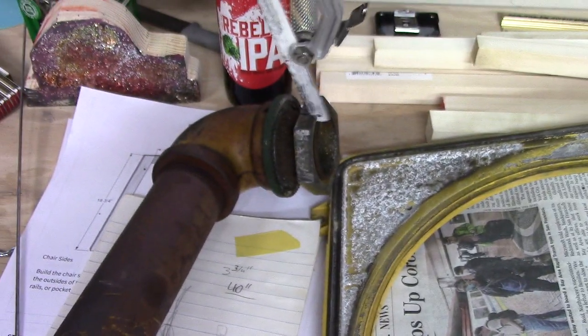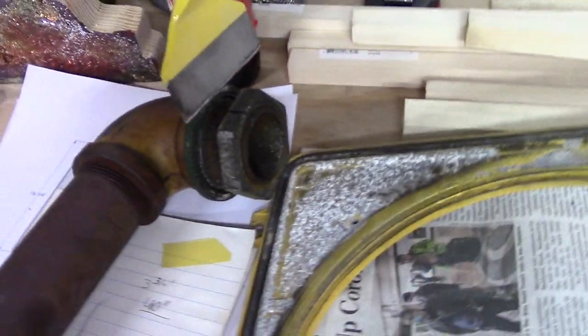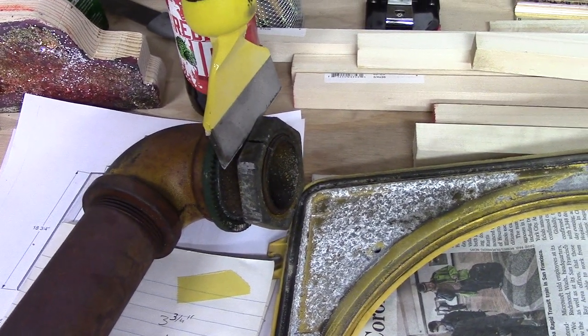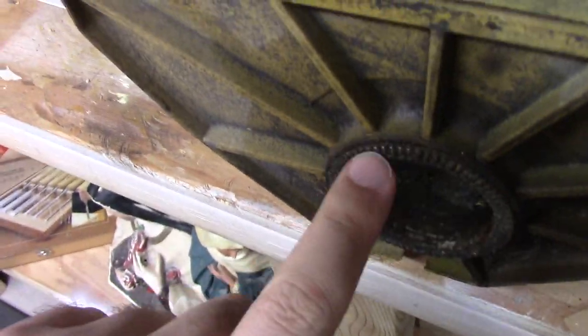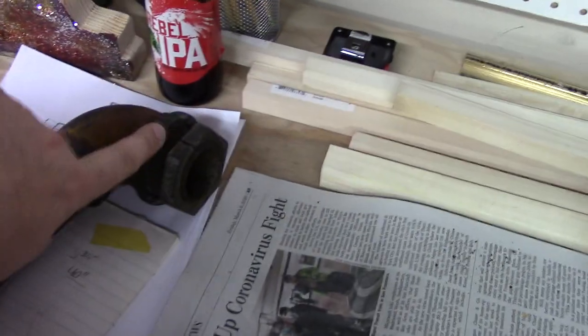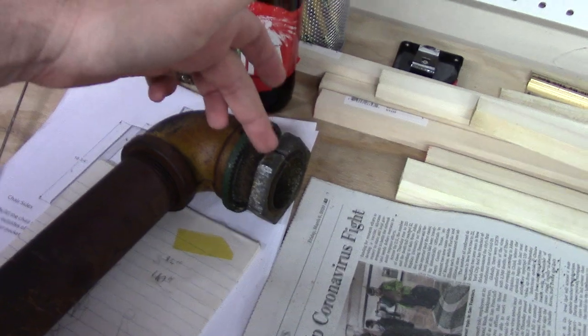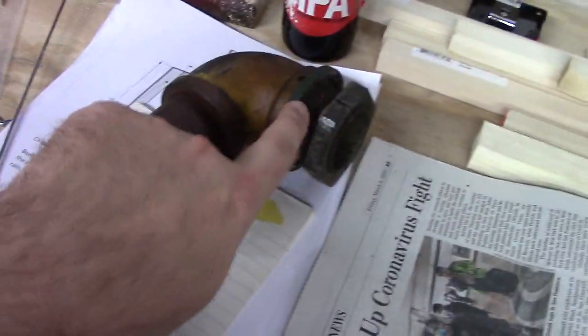I was able to cut the nut and the mount all the way through. Then he used this chisel and this hammer, putting the chisel between the light compartment and the nut to try to break it open a little bit more, and it was working great. If you notice on the other side, the compartment is toothed here, and so is this fitting on the pipe — that's to prevent the light from turning in heavy wind conditions when it's on a span pole or mast arm. So hitting it underneath broke the nut just loose enough for those teeth to clear each other.